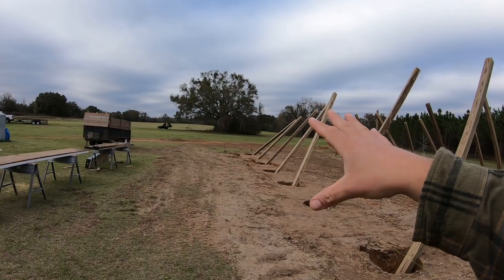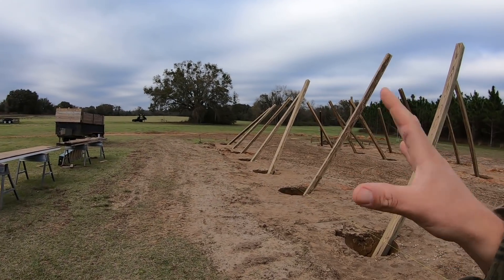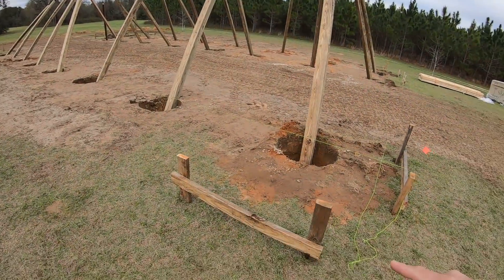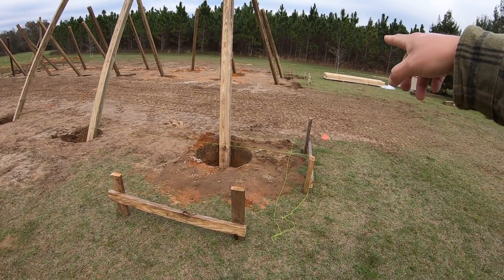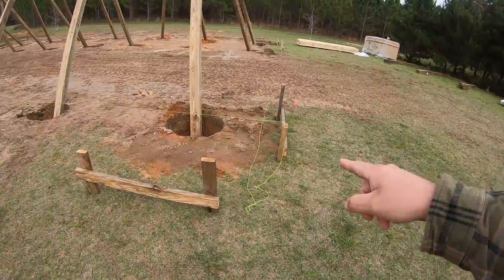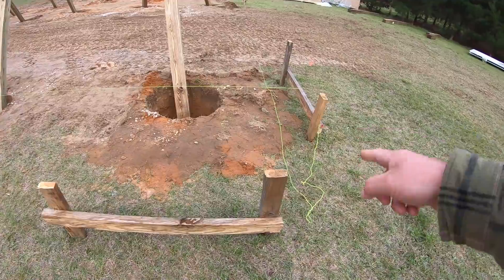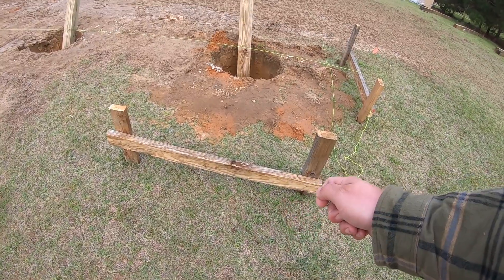So our view off the back porch will have a beautiful view of the field itself and not the house kicked over that way. The property just isn't laid out truly symmetrical — I wish that it was, but hindsight's 20-20. So once we established our line, they came in and started putting these boards in, measured over, and basically roughly squared up the building. It's 40 by 70 long. Then they pull strings and make marks on these boards.